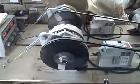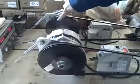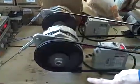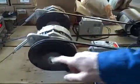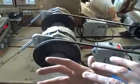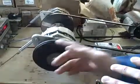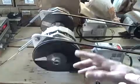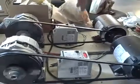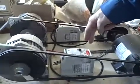The stroboscope is set so that the tape on that sheave is in clear view, and we're watching this one slowly rotate. The reason it's slowly rotating is that every time the strobe light flashes, we're a little bit further behind where we should be, so it looks like it's rotating backwards slightly. That's because this one is actually set to spin a little bit slower — I've got the frequency on this VFD set to 60 Hz, and the frequency here is set at 59.4.